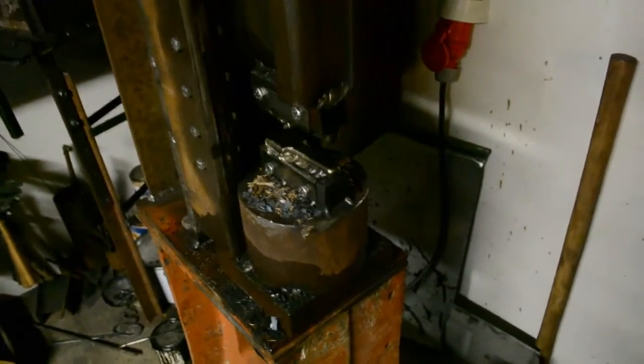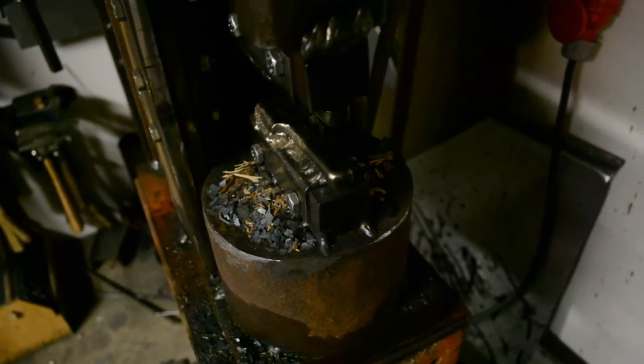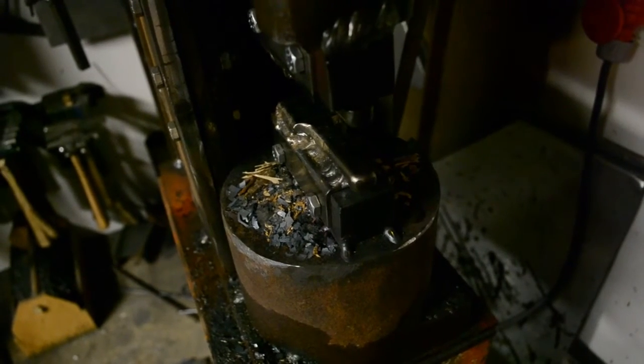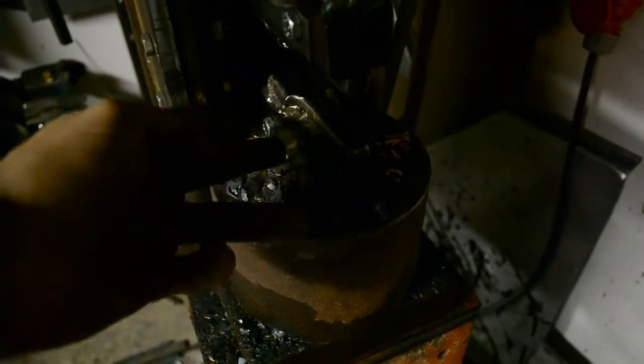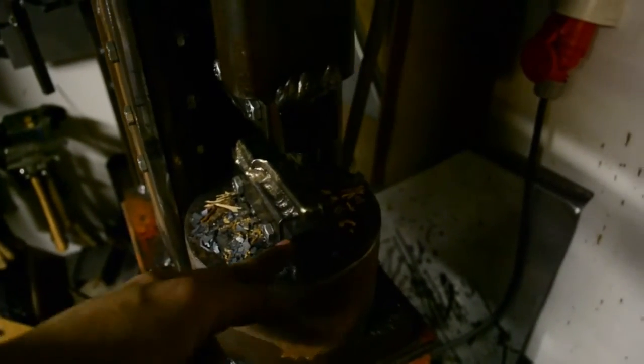The dies I just welded on. It's really square dies. It's C45 steel, and I figured I had those as a base. I made drill holes before I hardened it so I can put on various tools. I'm also considering doing a hardy hole like Last Frontier Knives.